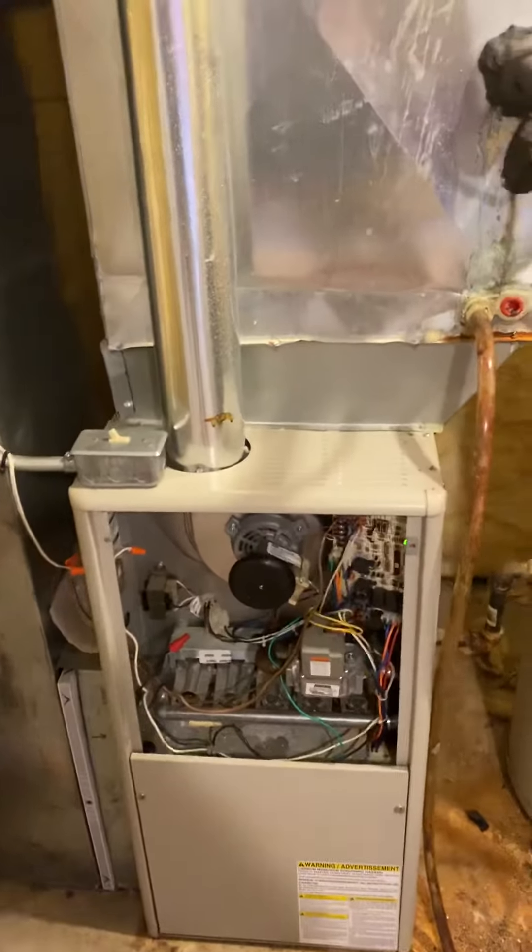Return drop from the concrete floor up is 87 inches, top to bottom. It is a 10.5 by 24 on the return, and we've got plenty of room to size that up to a 10 by 26.